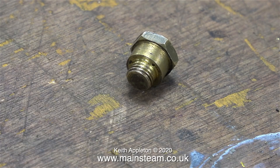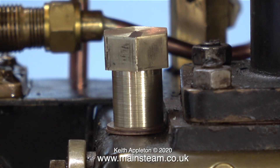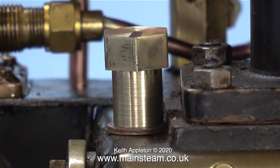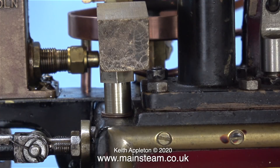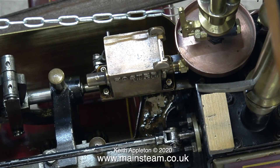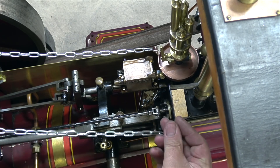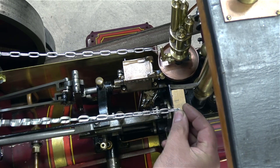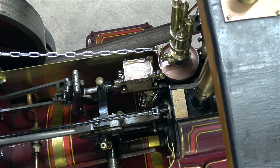There is a hole in the cylinder at the top and this brass plug is normally in the hole for no particular reason. I made and fitted a much longer plug. I'm now looking at different ways to mount the whistle — this is the gunmetal block shown earlier, before machining. This was a real problem: the lever from the safety valve is in the way. I intend to fit another piece of chain the same as on the whistle, but I'm going to have to rethink the mounting of the steam siren. Not only is the lever on the safety valve fouling the siren, it's not far enough out.